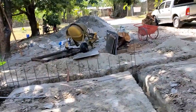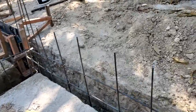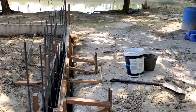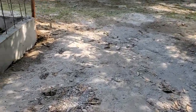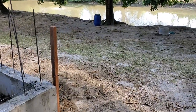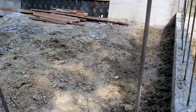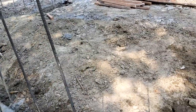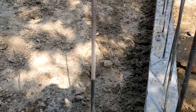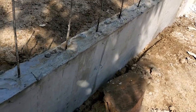So let me show you something pretty impressive out here. Instead of using hollow blocks — and this is a lesson learned — the hollow blocks here are about 17 pesos each. That's about 70-some blocks for one bag of concrete. One bag of concrete is only about 185 pesos, so the cost doubled. I wasn't willing to pay for that, so the crew mentioned let's make it a solid concrete wall. And that's what we did.